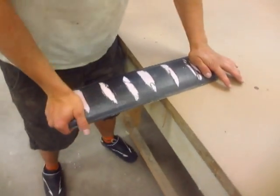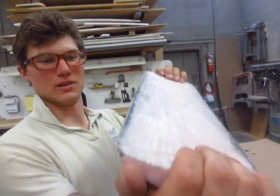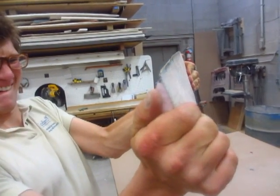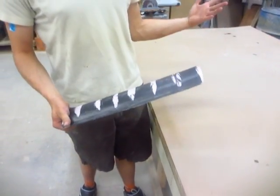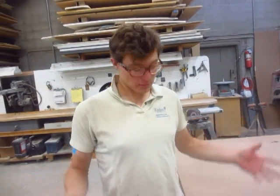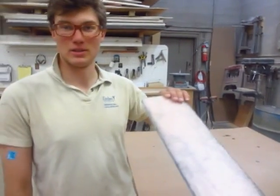We now have a ton of torsional strength. It will flex like this more than it will flex like this. It's not doing anything because it's really strong torsionally. It takes that much energy or effort to get it to torque, but it takes very little effort to get it to flex — which is ideal if you're trying to make a super poppy, playful skateboard deck that's relatively lightweight. So we have created a very basic structure from foam and single layers of carbon fiber and fiberglass that seems to work.